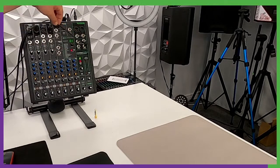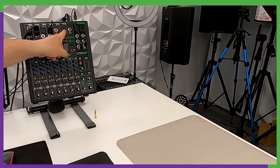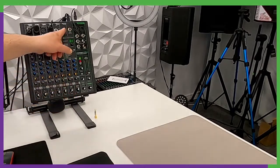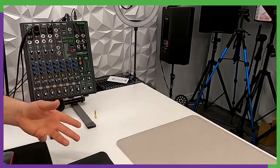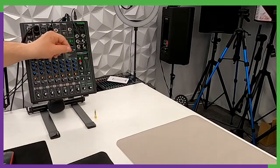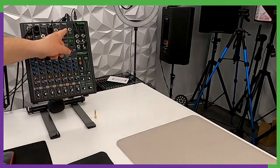And people do sometimes, you know, there's always options that people say, I wish it had like the old one did. They've taken away the RCAs and they put a 3.5 on channel 9 and 10. And that's not a bad thing because the RCAs were unbalanced and you're going to get the same unbalanced option here. It just means the cable you're going to buy. You can certainly buy a basically quarter inch to a stereo 3.5 and it will give you the same output. So it'll be unbalanced at each end with a balanced connection here. Basically stereo here with two mono connections.